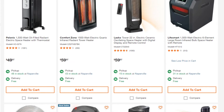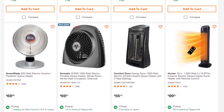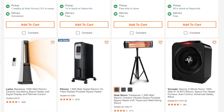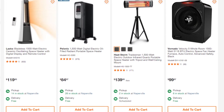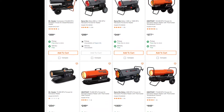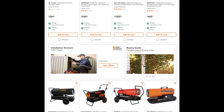Why this heater? First option was a 120-volt heater, but they top out at about 1500 watts, which is pretty lame for a garage. If you're standing right next to it, okay — but it really won't heat the space up when it gets into the low 40s.